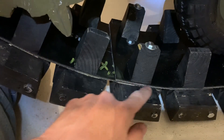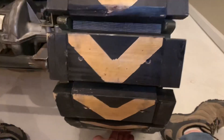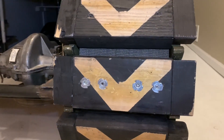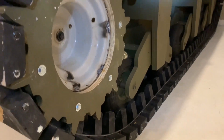I had to make one master link. On this one you can see there are two layers of belt — the belt starts down here underneath, goes all the way around, and ends here. I've got four bolts clamping that together through the two end connectors and two down at the bottom, then I wrap it all the way around. There are four T-nuts inside that master link so that it's serviceable. The other ones use wood screws because they'll go together once and stay there, but the master link I'll have to take off once in a while, so I used metal threads to make it reusable.